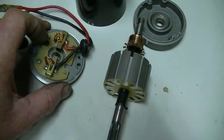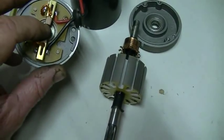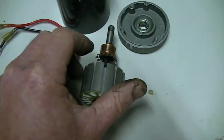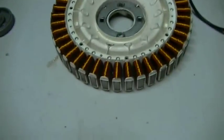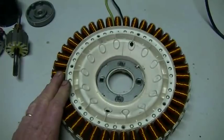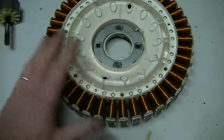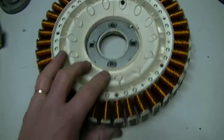With the second set of brushes we'll be able to see exactly what the voltage is across our two coils before they come in contact with the drive brushes. If it is greater than the supply voltage, we'll know why it's sending current back to the battery. For wire, we're using this stator out of a Fisher and Paykel Smart Drive washing machine motor. Every time it's throw-out day I go on the hunt for these because they're an excellent source of wire. This is a 60-series, so it's 0.6mm wire — just the stuff we want for the job.